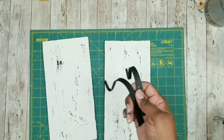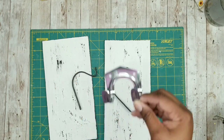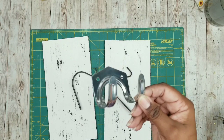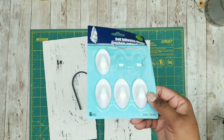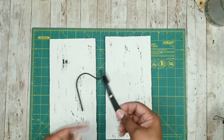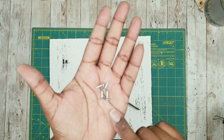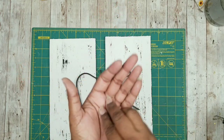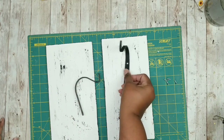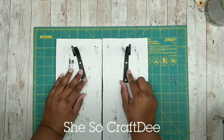Now I'm going to add these hooks — I got them from Amazon, I'll link them in the description box below. You can also use utility hooks from the Dollar Tree or even the peel-and-stick version to accommodate this project. These hooks have little drill holes, and I'll be using three-quarter inch number-six wood screws. They came with screws but I misplaced them — the three-quarter inch number-six screws fit perfectly.